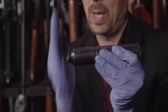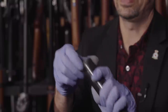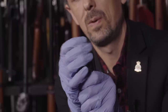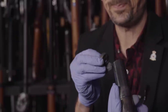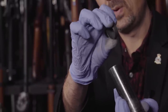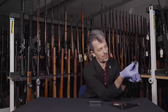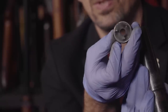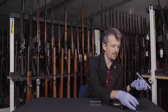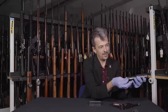It's a fairly straightforward design. Inside there is a steel plate drilled with holes for an initial expansion chamber. We can unscrew the knurled end cap and see the contents of the suppressor. Each of the baffles is a pressed piece of steel turned into a cup, with three radial slots pressed into that steel — a relatively distinctive looking baffle. There are a number of these inside, as you'd expect — that's how suppressors work. You're baffling the gases as they pass through.